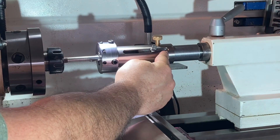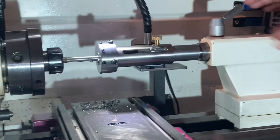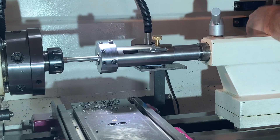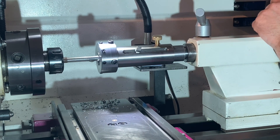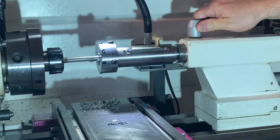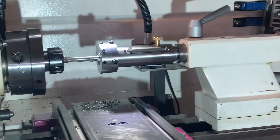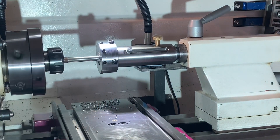I was getting too close to the end of its travel. What you do is just slide it along, loosen off the tail stock and slide the tail stock in like that, clamp it back down again, then keep going. That was the idea why there's so much length in this — just in case I wanted to cut some long threads.